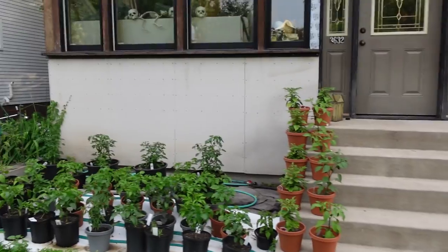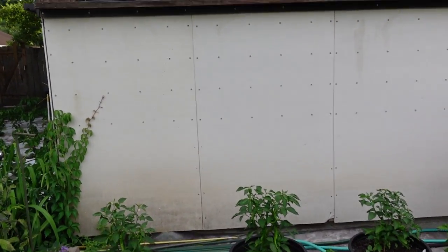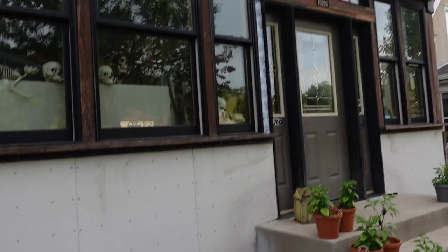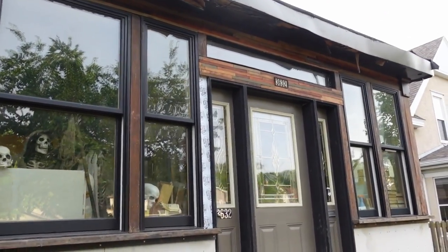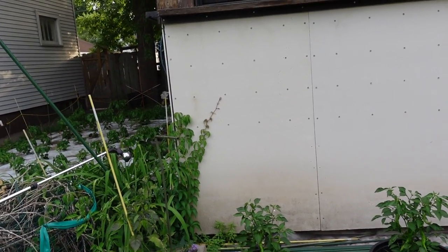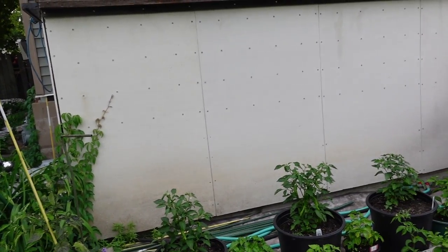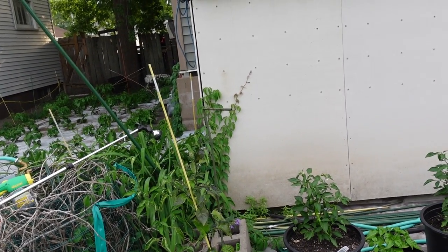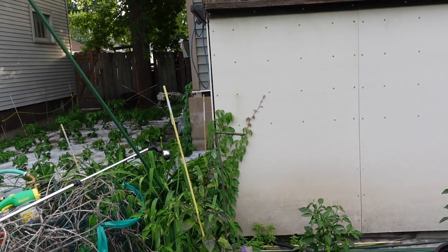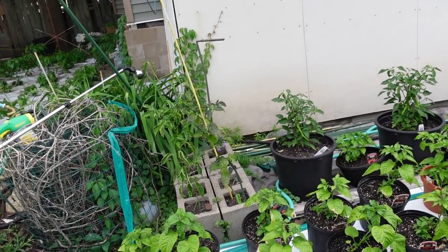All the white board you can see there is fiber cement board — it's entirely waterproof, but it's just not very pretty, so I'm going to put wood on it in various pieces and try to echo the woodwork I did for the lintel above the door, doing it in different colors and lengths. It will be slightly different thicknesses, so it will have a little more texture. The reclaimed wood has all sorts of imperfections in it. The wood will be treated to prevent rot and decay, and it will also be hardened so it won't be the soft wood it is now and won't decay in the weather.